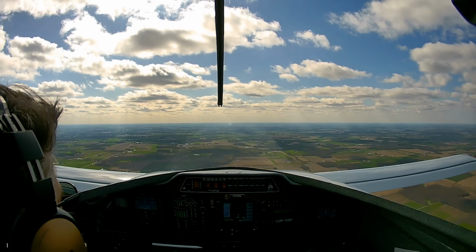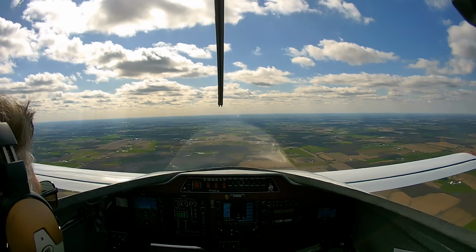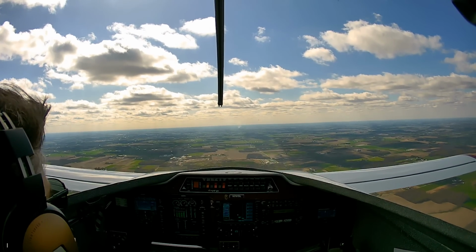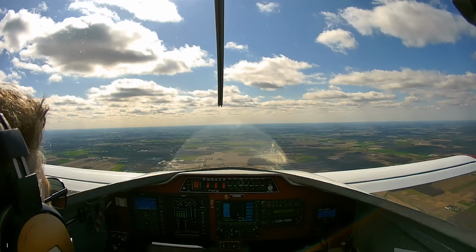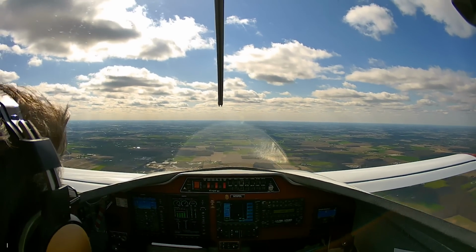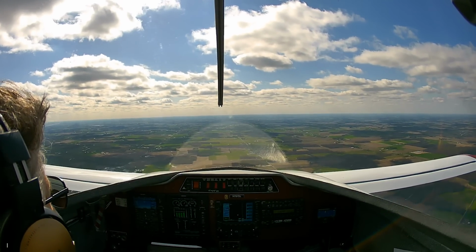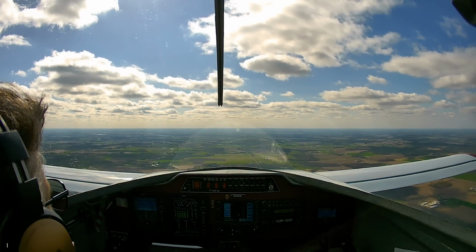So here we are at 71% power, and I'm in the high 300s. My number 3 is the hottest at 395. Number 1 and number 3 are still hot. I gotta pull back speed a bit because I'm hitting some turbulence here. Number 1 and number 3 are still hot, with 2 hot too. And those used to be my cold ones. 2 and 4 are now at 368 and 361. 1 and 3 at 372 and 379.